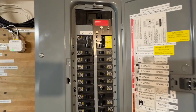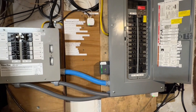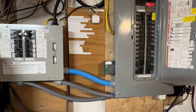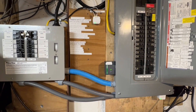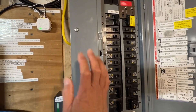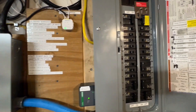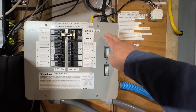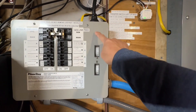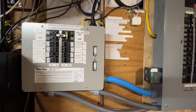And here's my main — just added that interlock system. I'm not going to tear down this entire setup or remove this transfer switch because my future plan is for attaching a solar panel system onto that. Again, when you're connecting to the main, you want that generator unbonded, meaning the neutral is not bonded to the ground. When I connect it here, this is set up like a sub panel, and therefore it's not bonded. That's when you flip the switch on the generator and bond that neutral with ground.